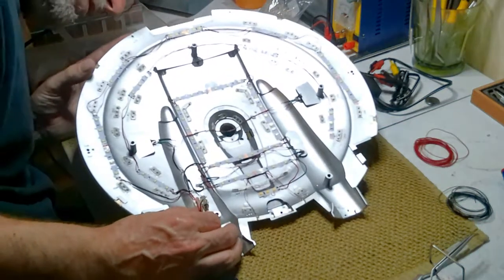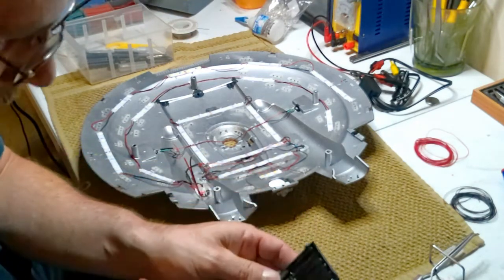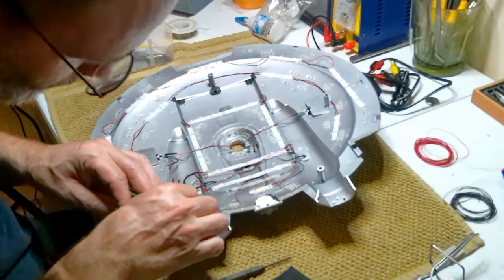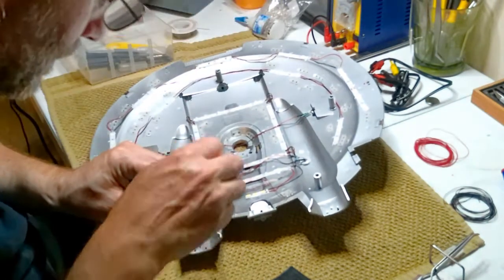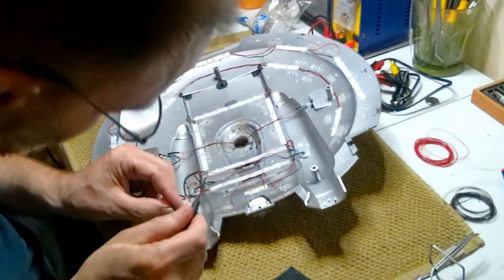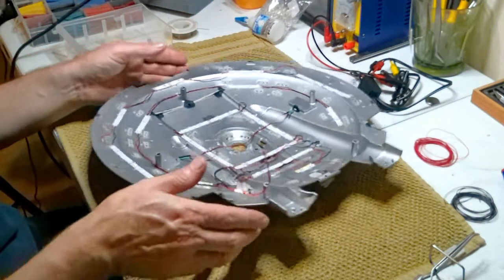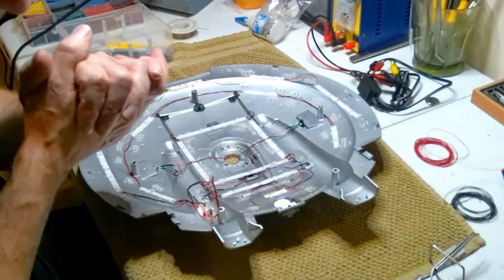So actually, the thicker the gauge wire, so if you bundle a bunch of these small ones together, it definitely gives it a better grip. Try to get you under there again. And definitely soldering the wire too helps. And I'm soldering all the small ones too, so they don't all just spread when the screw comes down. There we go. I don't want some faulty thing to happen with that. That's why sometimes I'm wondering if it would be better off to just, like I always do, solder them into one thing and shrink tube them.